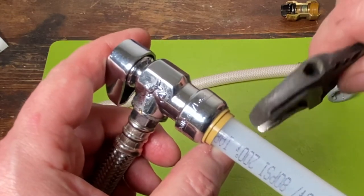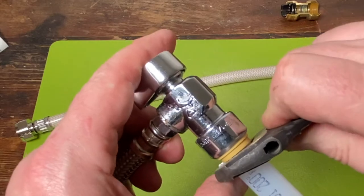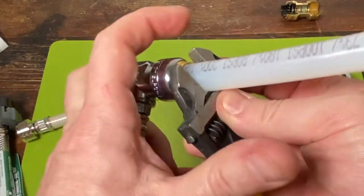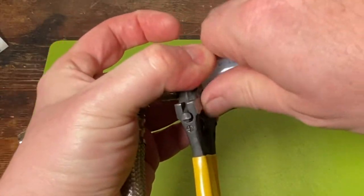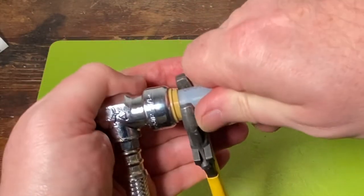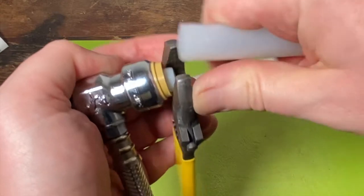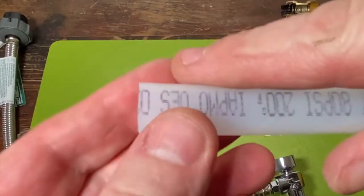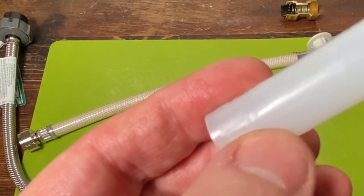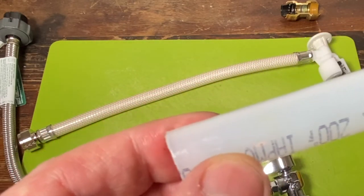Where I can never find that little tool, I actually just use my little adjustable jaw. Get that bad boy on there, you can grab it and pinch it on three different sides. Then you're able to just take this - you kind of have to push down and pull out at the same time. If you get that in there, you're able to push that down and then this just slides right out. With the SharkBite, you're going to get a couple little grooves on that, but it actually allows it to slide out. You could totally reuse that - not going to be a big deal.